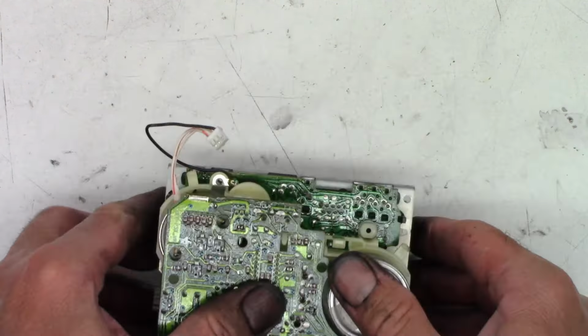So like I said, I've gone ahead and lubed up the motor shaft. Everything should be good. So once that happens and you have your belt around here, just go ahead and peel it off. And then hopefully if everything is aligned correctly, you won't have any twists in it. That one looks good to me. And this one, peel it on to the pulley just like that.